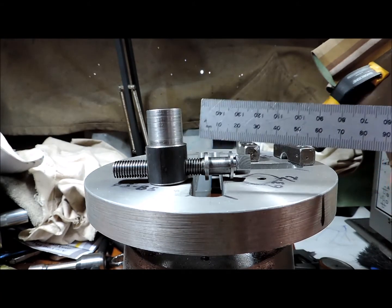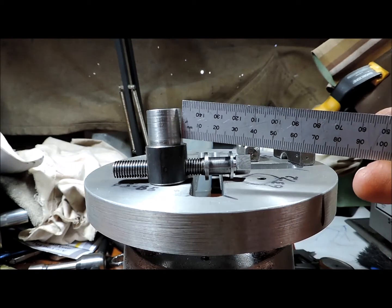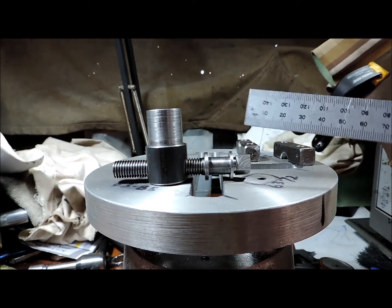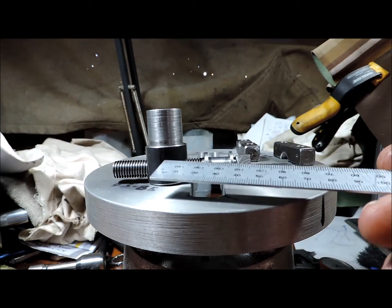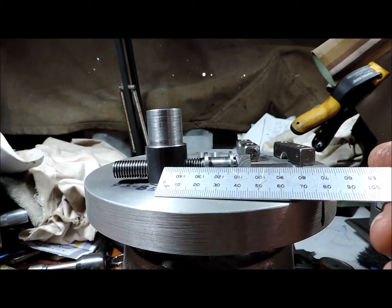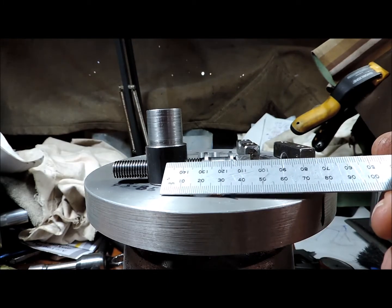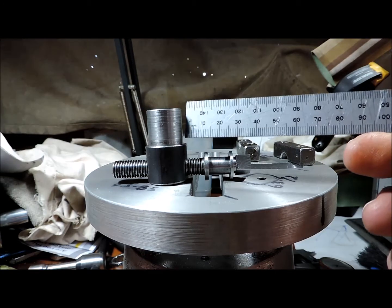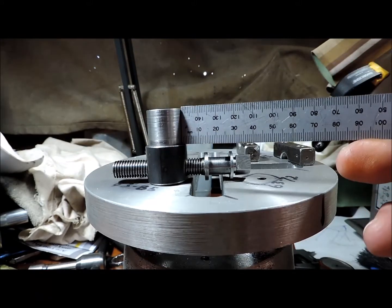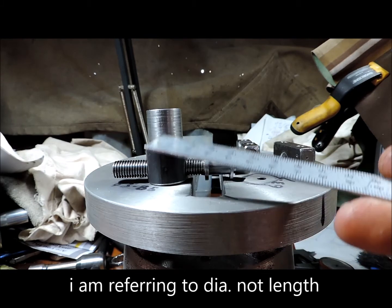The jaw nuts need to be worked on now. That shaft there is 20mm and it's got to come down to about 17.3 to 17.5mm. The reason I'm making this 18mm and not 20mm is because the stock is 24mm, not 25mm or 25.4mm. Gingery calls for 1 inch — 25.4mm — so I've already lost 1.4mm in diameter. I'm making this shoulder smaller to compensate, reducing it to 18mm to increase the shoulder size. It's got to go back in the lathe for that to be machined.